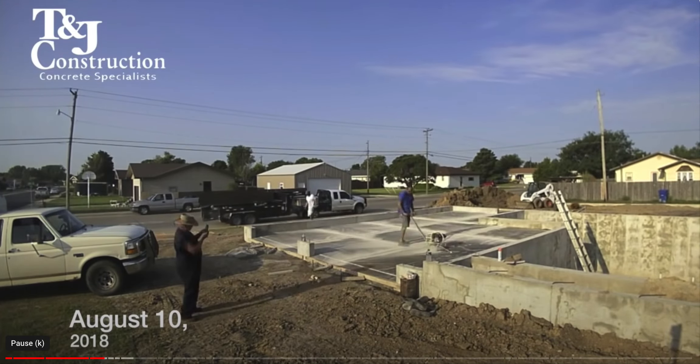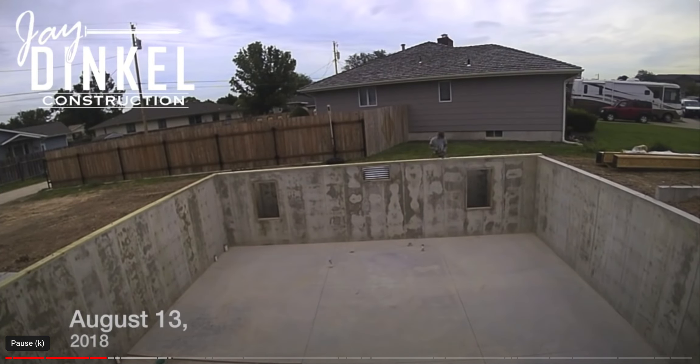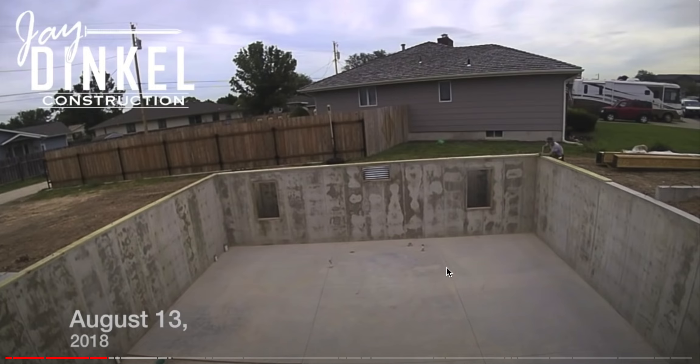He's cutting in joints to prevent cracking. With the basement they did construction joints — pouring part at a time — while here they cut them in afterward. You can do it one of two ways to help control cracking from spreading across the entire slab face. You also see this in driveways: with a poured concrete driveway they'll pour it in sections and fill the joint between the two slab faces with an elastomeric material so it can expand and contract, which helps prevent cracks from running the whole length of the driveway.